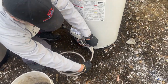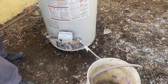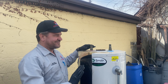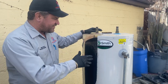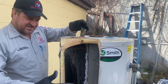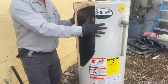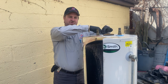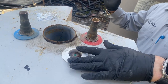There's our drain right here. Put that hose into a bucket or a floor drain nearby — remember, gravity won't bring water up if the hose goes upstairs. We don't need to drain the whole entire tank. In fact, I want to use the weight of the water — keep in mind this is a 50-gallon water heater at eight pounds per gallon — to help me use a tool to get out that anode rod. The anode rod is on top; sometimes it's covered up.